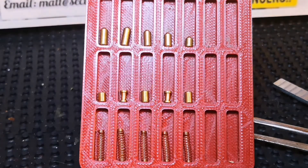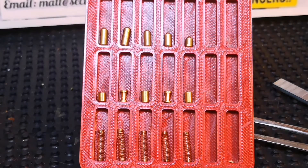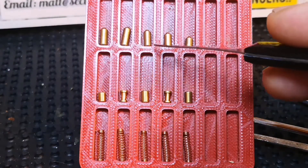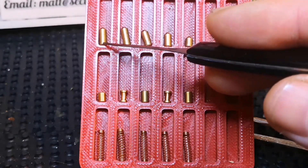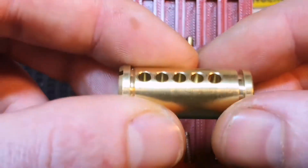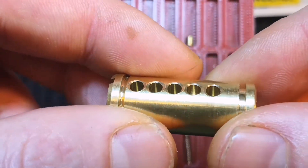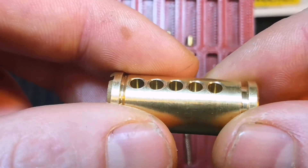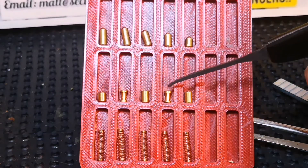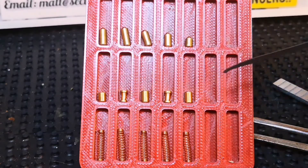We'll have a little look at the pins face and I'll explain exactly what's gone wrong with this lock. If we have a look one through to five, we've got bevels and tapers — only little, not too excessive, but it's on each key pin one through to five. That, combined with the counter milling we've got on the core here, is a nice little additional security measure. When we come down to the drivers, in chambers two and four we've got two spools; one, three and five are of course standard.